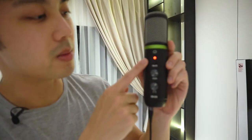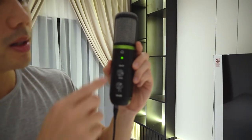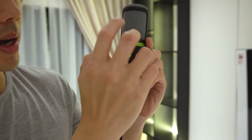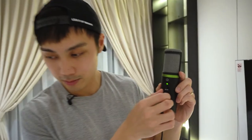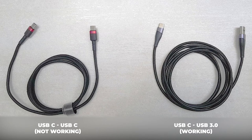If it's red that means it's muted, and if you unmute it turns green. Unfortunately the LED doesn't tell us whether it's clipping or not — if I gain it to the max and clip the microphone, it does not change the LED color, so that's something Mackie can improve on. In my test I used a USB-C to USB 3.0 connection on a computer. I tried USB-C to USB-C and it didn't work. So anyway, let's get going to test this.